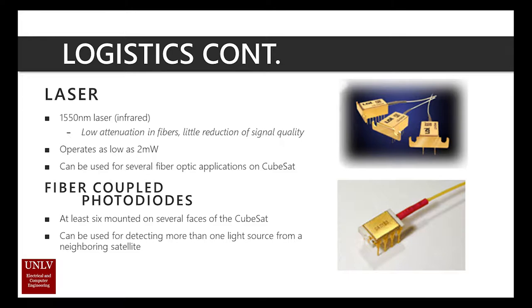The photodiodes are specifically tuned 1550 nanometer type sensors that will receive light input from the laser and output low voltages. In order to read them properly, they may need to be voltage amplified so that the ADC channels in the mixed signal processor can adequately read them without noise. An explanation of how these items will be arranged follows.